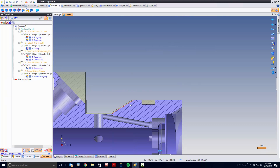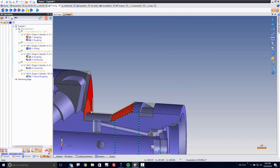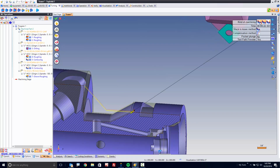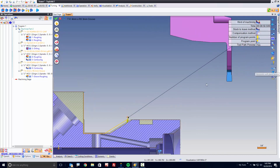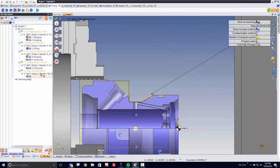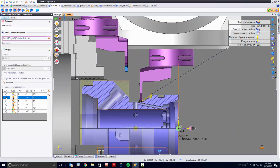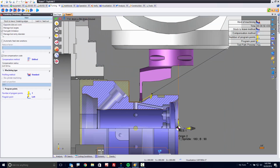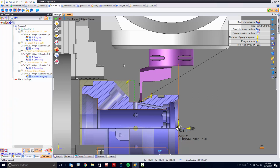Last step we have to do is finish that face, so let's go ahead and do that. I'm going to select that face. I'm going to go to finishing, and in this case, I'm going to switch back to that groove tool again. Look straight at it, and I'm going to use the same orientation the tool is already on, right? So I want the tool inverted, which is perfect. And now I'm going to tell this to finish from two sides. So this way I can plunge down this way with the tool, pick up, come over here, plunge over, pick up. Let's have a look at that.